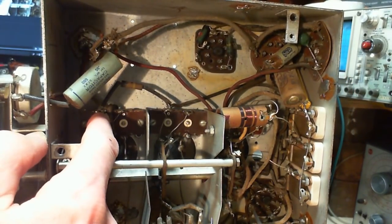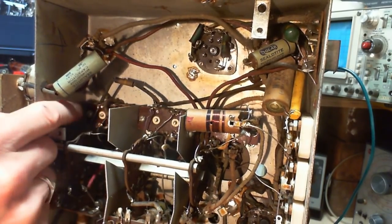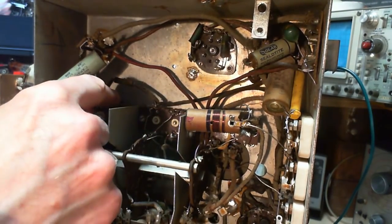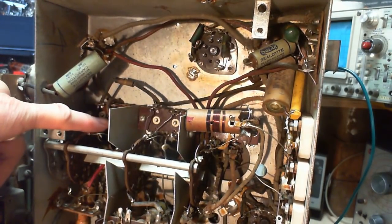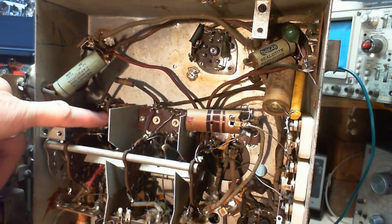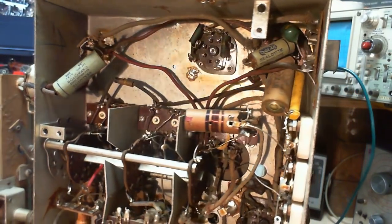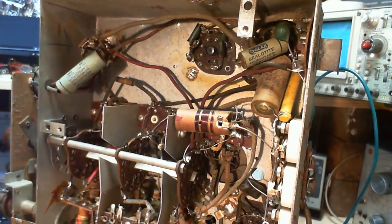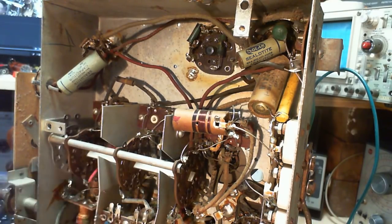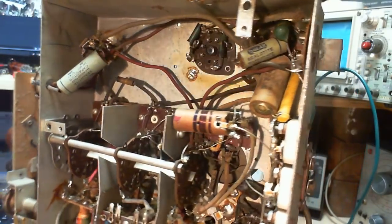Old wire coming up, and it's just laid up against this sharp edge terminal post there. There's all kinds of potential for short circuits in here. There's a bare wire with that insulated wire under it, and the insulation is cracking right where they're crossing. What that tells me is the more I fiddle around with this, the more likely I am to bend wires, and the insulation is going to crack off, and then that'll be a problem.